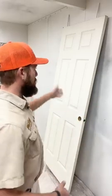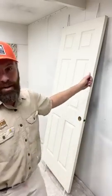All right, so we have a typical door here, and I'm going to simulate. I didn't have a job site for you guys today, so what we're gonna do is simulate a steel passage door or a passage door in a house. This could be the front door, this could be the door to the garage. Typically, these are hung, and they're always painted the color of the wall. Once in a while, if you get a house with white trim, they may also put a little bit of the white trim paint on there. But when we go through and repaint all the walls in a house, typically we're not gonna bring a sprayer in to spray 1 door like this. We can get an amazing, amazing finish with a brush and the right paint on something like this.